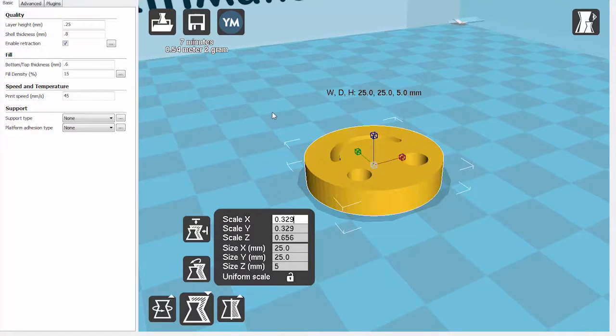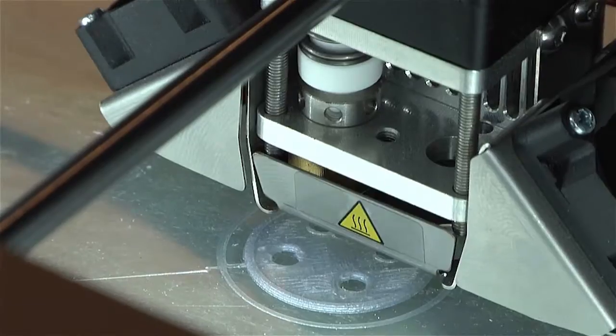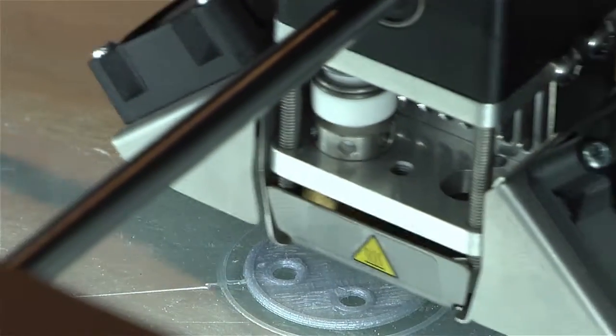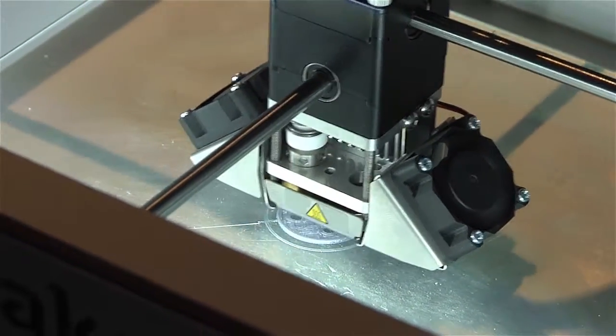Layer height is the thickness of each layer deposited by the 3D printer. Acceptable layer heights vary by machine, but for many consumer-level printers, it can vary between 4/10 and 1/10 of a millimeter. Layer height has the most direct effect on print time and print resolution. Essentially, the smaller your layer height is, the more layers total for your print, which equals a longer print time.